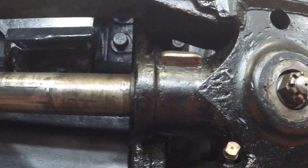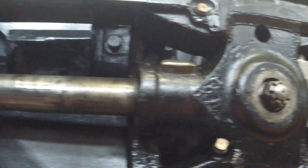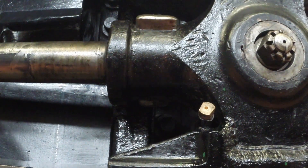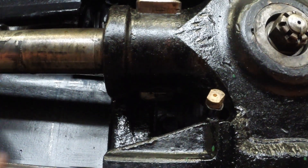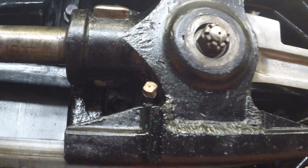The loads here go both ways as it's double acting, so not only do you have the piston pushing the crosshead, you also have it pulling it on the forward stroke. So it's that key and that taper fit that keeps it all together. The key there is retained mostly by its seat — you have to smack it in pretty hard with a big hammer, but it's actually retained with a split pin, basically like everything else on the steam engine. It's a special one.